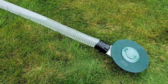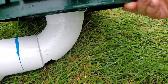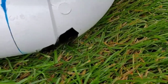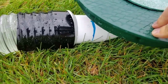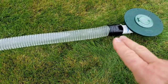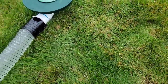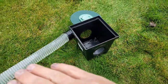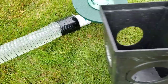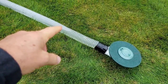You can see there are a few feet that hold water. We taped up the hole on this three-inch elbow to do this demonstration — to show what you'd end up with if you don't design the system to perk. You have just a couple of feet of water left. That's great with one percent slope — not a big deal, and not a lot of water. A basin, by contrast, holds a lot of water — like a five-gallon pail — so in clay you're never going to get that to perk in a small area. That's the problem with drain basins.